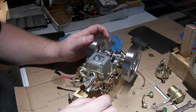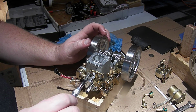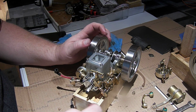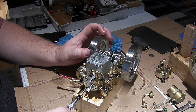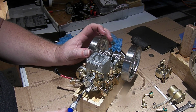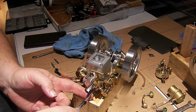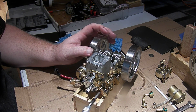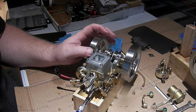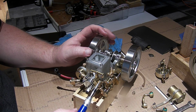And you need that space there because, especially on bigger engines, as they heat up and the parts start to move around, that gap will change. And if it disappears entirely, then the rocker arm will hold the valve open slightly and it won't seat properly. And I don't know if it was that way at the factory, because I was very careful keeping this in order when I popped it off, or if I accidentally twisted that clevis.